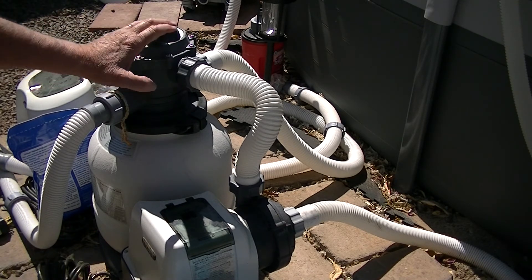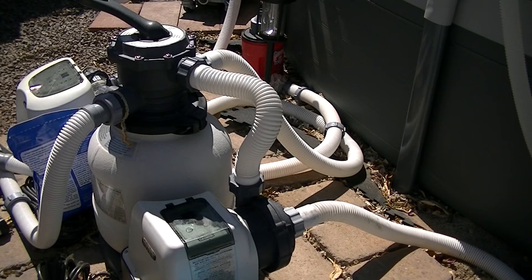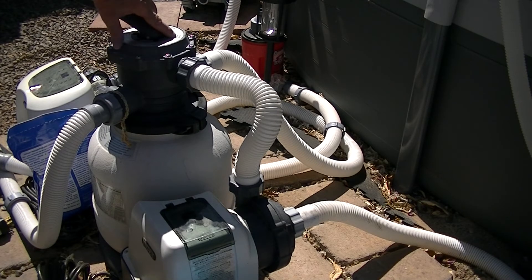What I'm gonna do is turn this right now to closed, because I want to set everything up right. Then I'm going to turn it back over to waste. The waste setting is actually for lowering the water level in your pool fast if you've overfilled it. But I don't want this mud going back into the pool — I don't want it going through the filter. So it's gonna go through the pump and be pumped right outside. I'm getting rid of all the mud quickly and easily, and I'm not putting it into my filter so it's not going to clog the filter. I will still backwash the filter before I turn it back on.